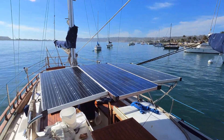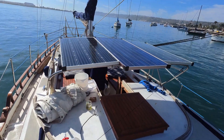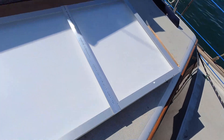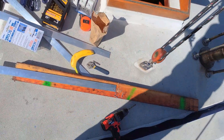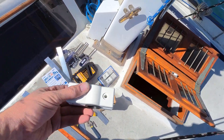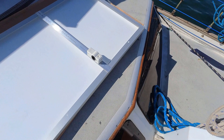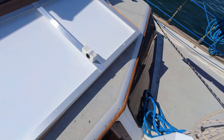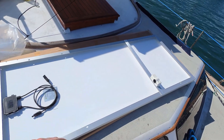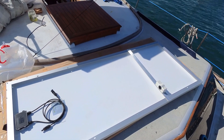The boat already came with three solar panels mounted right there on top of the dodger cover. I'm going to have a whole new dodger made, and I've got two new panels — one of them being right here. I'm going to be installing some brackets. First I'm putting in some aluminum cross pieces — you can see me drilling that here. Then I'm going to be adding mounts to those rails, and that will allow the panels to swing up. I'm also going to work on a brace bar that will attach somewhere in the middle and be pushed out from the lower stanchion pole to add the support needed to keep them in their operating position.